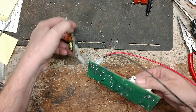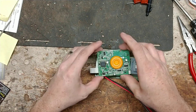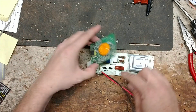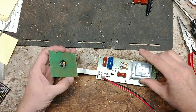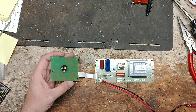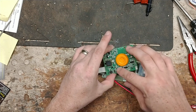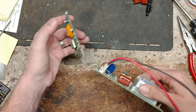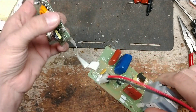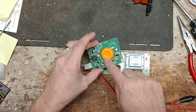This is one of their later style boards. When you buy a brand new S50 or even the Gallagher S20 old-style module, it comes with both boards. What was wrong with this one is this particular board was bad — and you can't buy just this board. So I had a cluster of boards, some good, some bad, and basically transplanted a board from one of those, since the S20 and S50 share the same board. We desoldered and soldered a new one on, powered it up, and it worked fine.